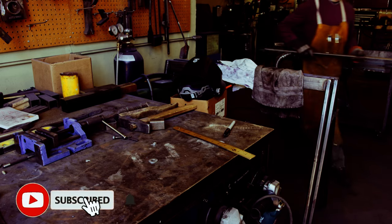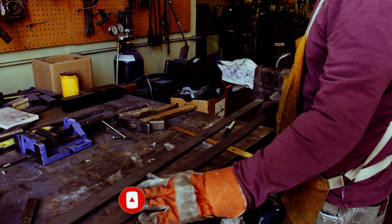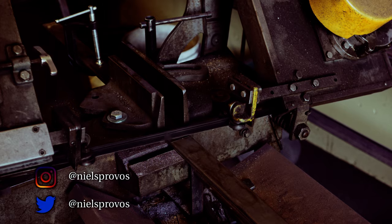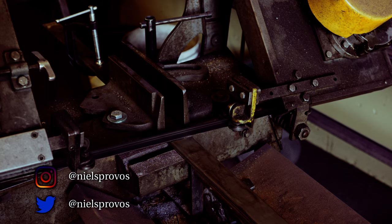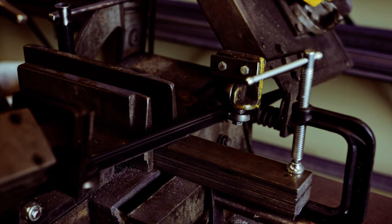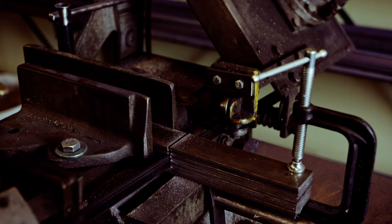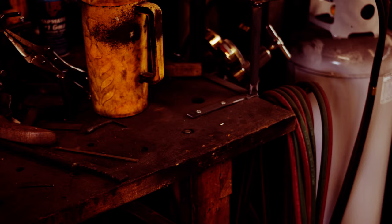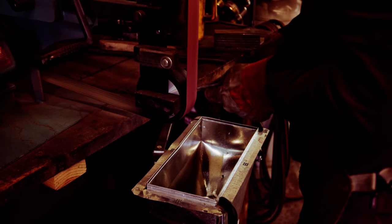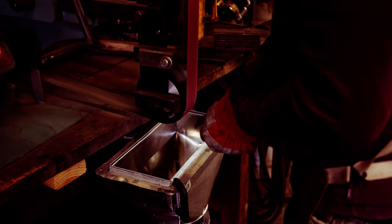To get the distinctive Beskar look for real, a lot of forge welding is required. This is the process where different types of steel are fused together under pressure and very high temperatures. I am cutting 6-inch long strips and will assemble a 15-layer billet for the initial forge welding. In the end, I am looking to get roughly 150 layers over 5 inches, or 30 layers per inch. This will mean forging and assembling two more billets after the initial forge welding. For this work, I need to keep the material quite clean.